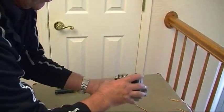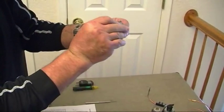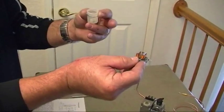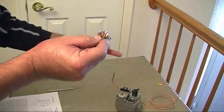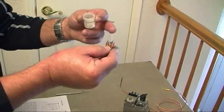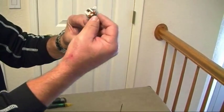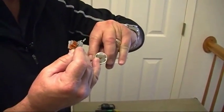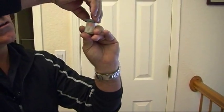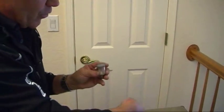Let's look at the windings around these two steel posts. When the millivolts come through the thermocouple, they magnetize these two steel posts, which pulls in the main spring. This is called the keeper — it gets attached and pulls up, allowing the gas to flow through to the pilot.